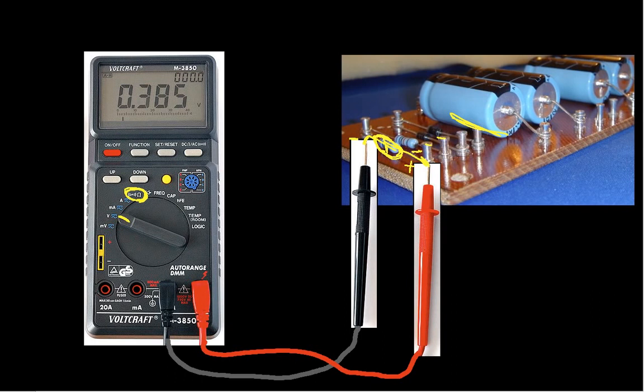This, for example, turns out to be an issue if you want to measure the resistance of a light bulb. An incandescent light bulb operates at about 2,000 degrees centigrade, something like that, a fairly high temperature. Its filament is tungsten, and it turns out that when tungsten is hot, its resistance changes dramatically. So if you connect the two probes to a cold light bulb, that is a light bulb that's not in the circuit, you'll measure a fairly low resistance. You'd want to measure the resistance of the light bulb as it's in the circuit, as it's powered, because when you power the light bulb, its resistance changes, but you can't do that with a multimeter because you can't measure powered elements.